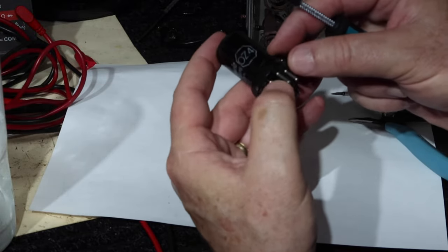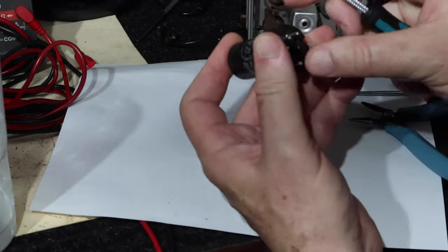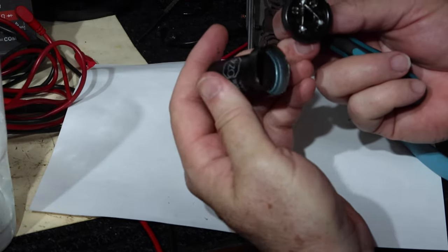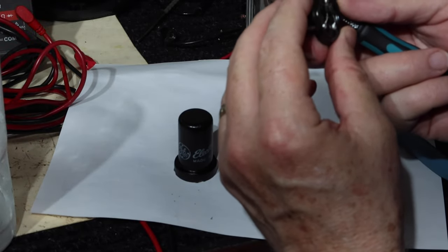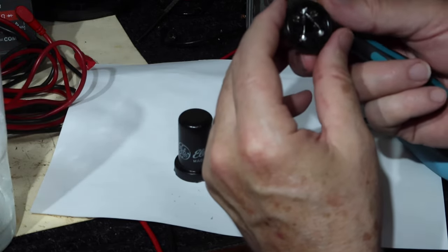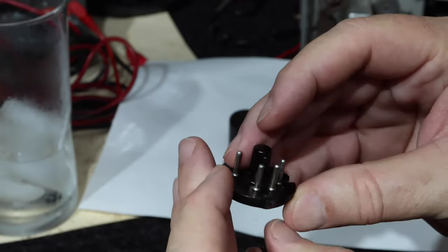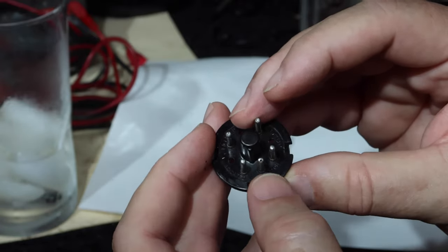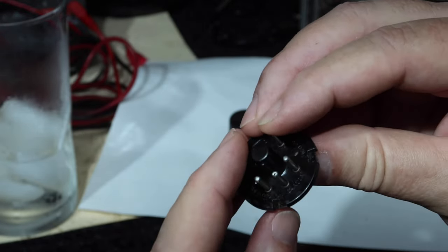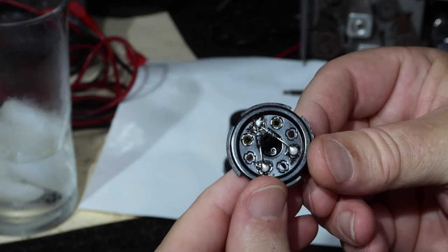So the index is pointing to the right side of the 0Z4 indicator. Okay. No resistor. So what we've got is a couple of diodes here. They're 1N4007s. Cathode goes to pin 8. Correct. And then I believe it's 3 and 5. Let's see, 3 and 5 go to the transformer. Right. Let me work on this.